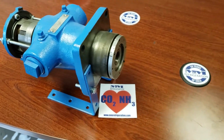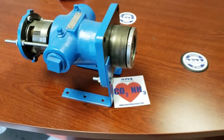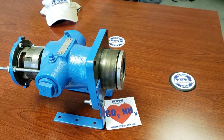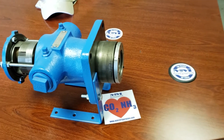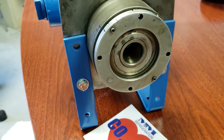This is just a little display model we've got here at the shop. First thing you want to do is follow your safety protocols, your lockout/tagout. Make sure all that is safe because you will be grabbing the shaft of the motor to turn it back and forth as you make this adjustment. Once you get all that done, you want to take the covers off to expose the coupling.